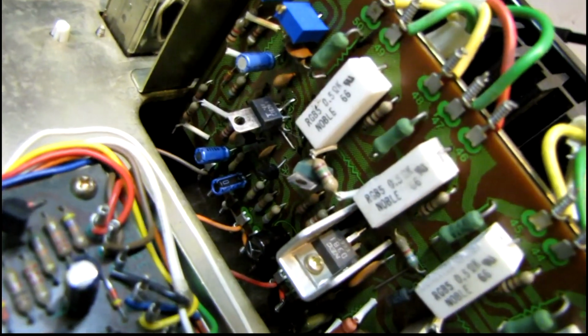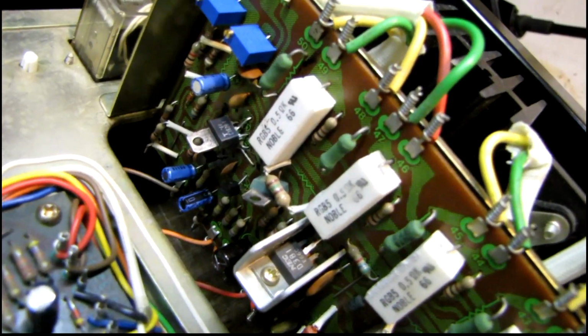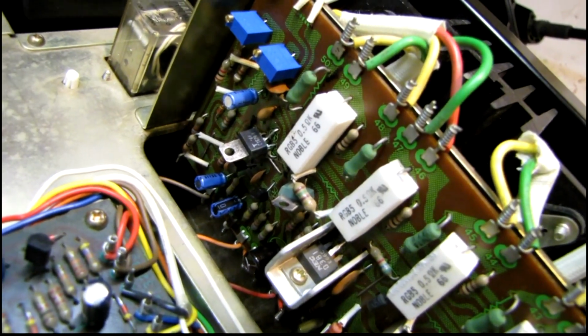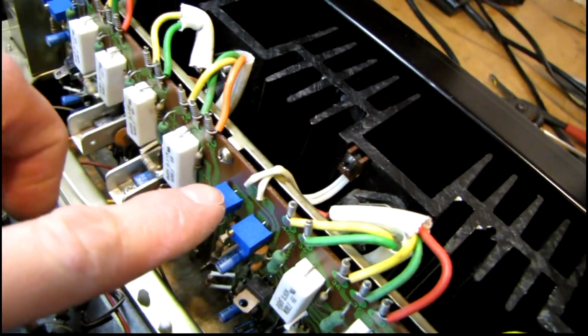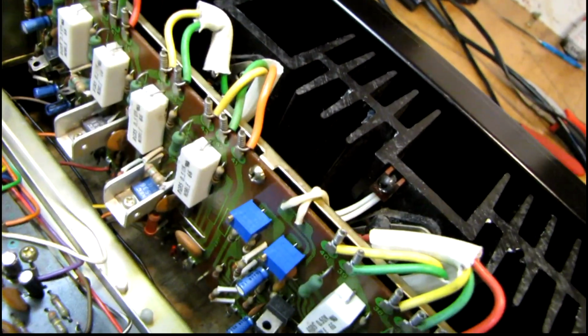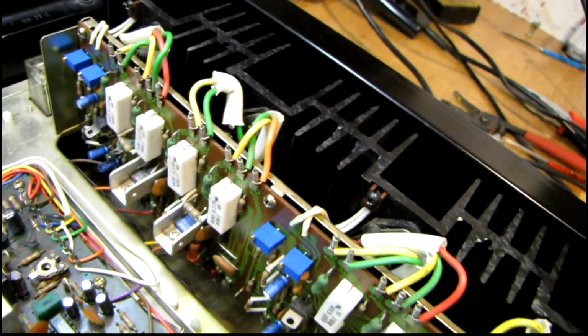And the labeling, the board is labeled for the positioning, but it's a little bit hard to read because it's just a transistor schematic symbol. It doesn't actually say E, B, and C like Marantz does, for example. I've also replaced the potentiometers with multi-turn type, and they come from the factory set about mid-position, which should be okay for this starting off.